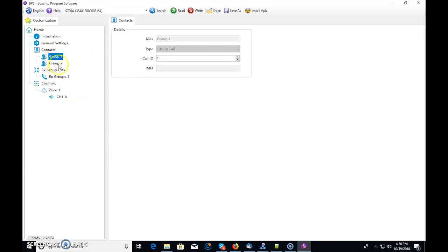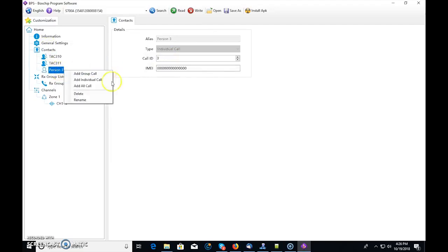We'll add a group call. All right, we'll call group 1. We'll call this one, we're going to rename it to TAC 310 because I don't get on TAC 310 anymore. But there's TAC 310. Leave the IMEI blank. We'll go here and we'll rename this one TAC 311 because I've been on there before. All right. And the call is 311. So that's your call. If you want to make a private, you can go add an individual call. And I could name that KM4MCK, and I don't know his ID, so whatever. We'll come up with like that. All right. So there's your making contacts.